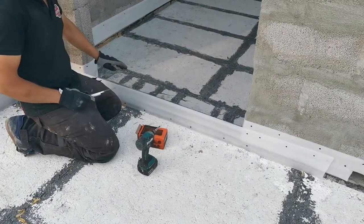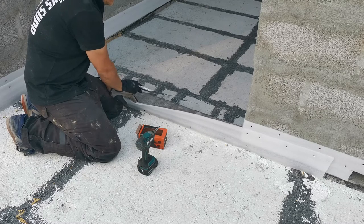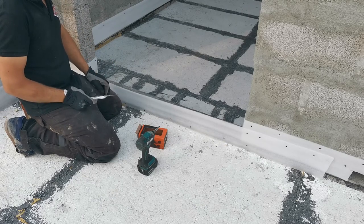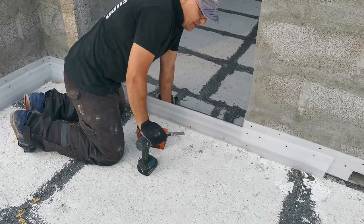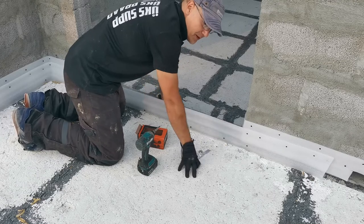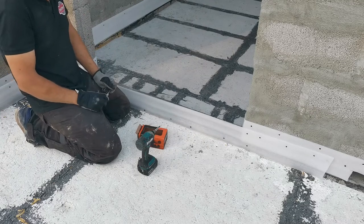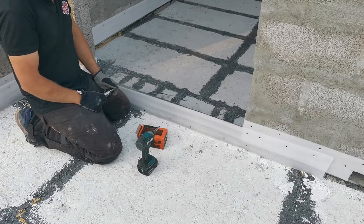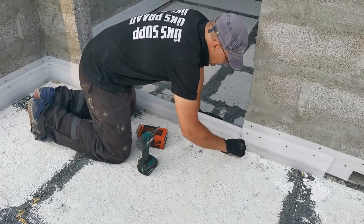Now to show you how I make this, this is a doorway, and how I make the bottom side. Usually this isn't insulated, but as it also affects the concrete slab, I will use a different method than they commonly use. Why I have two layers, first and second, isn't because I want this, but this is the highest insulation material that it's possible to have, and my slab is quite higher, and I want the thermal mass, so I have to use two rolls on one wall. And the way I do this one is that I cut it open.